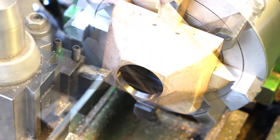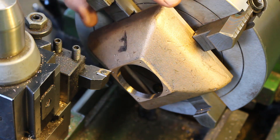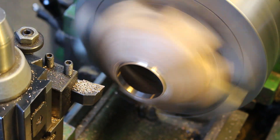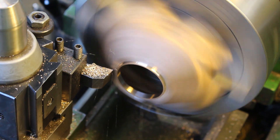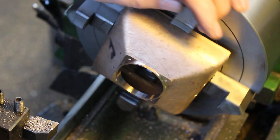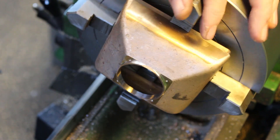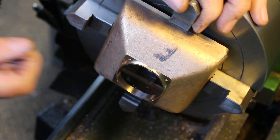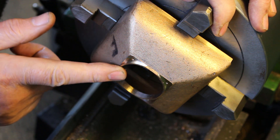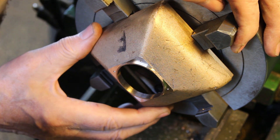So that's 46 millimetres. I'm going to machine this face back a couple of millimetres just to create a raised circular portion. I think what I'll do is make a ring to silver solder in there, leaving it slightly proud, and then once it's silver soldered I'll put it back in the chuck and face it off and true it up on diameter.